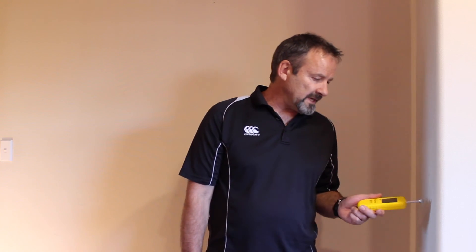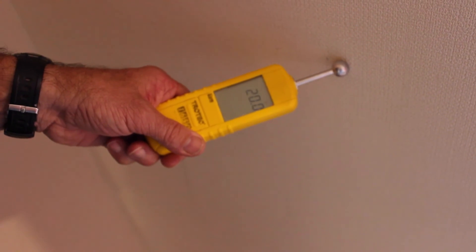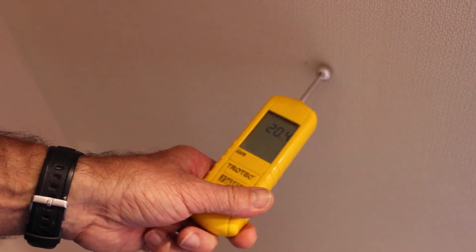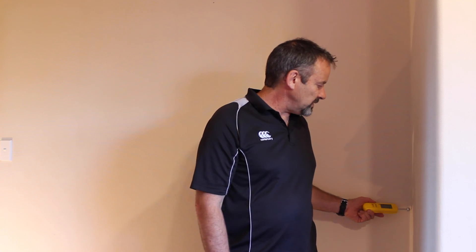The camera is great for finding small spots such as a small roof leak, which can sometimes be hard to find with the meter alone — I can look through the camera and locate the spot, then confirm it with the moisture meter. When you're actually placing your meter on the wall to take your reading, keep it as much at right angles to the wall as you can, as increasing the angle of your meter will change the reading slightly. Also remember not to put it too close to a corner or in the corner of a skirting, as you'll get a false increased reading.